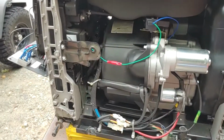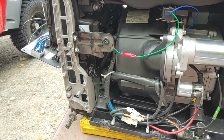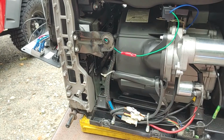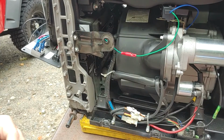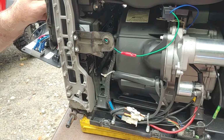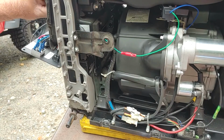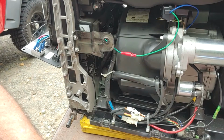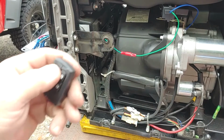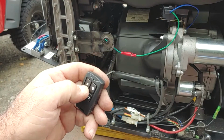All right. So, if that's successful, it says we're going to do a full start test, right? Choke test is successful. Turn knob to run. Press A for 1 second. It's successful. Press B to stop generator. Ooh, we're so close. All right. So, we're going to turn this knob to the run position, which will be one. And here we go. Let's see what happens here. 1 second to see if it runs.